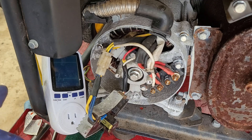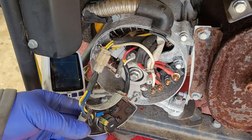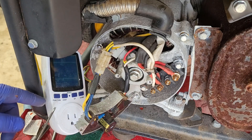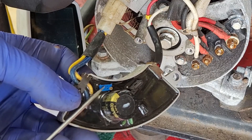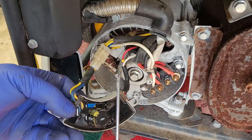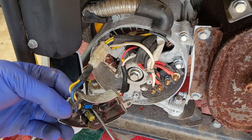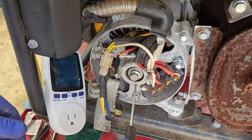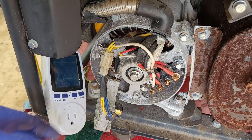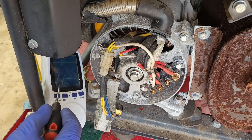I realize this is probably more advanced than how the video started out — I apologize. But if you're going to attempt something like this, you're going to need a voltmeter hooked up. Pull off your AVR — it's just two screws — and here's the pot that you're going to turn back and forth. You need a small screwdriver to get in there. Start it up, make sure nothing is near the spinning bolt, and then slowly adjust the pot while watching your voltage.